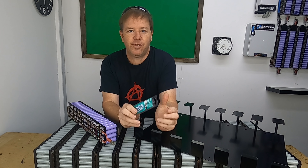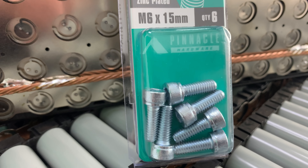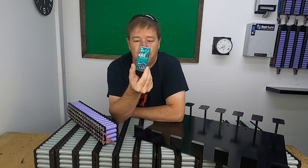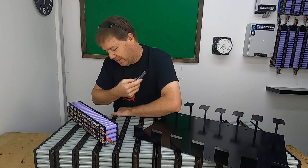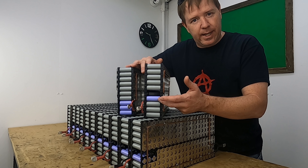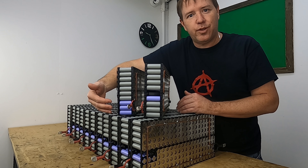The cells themselves will be joined together via the terminal lugs using M6 15-millimeter hex head screws and nuts — standard stuff really. With these blue cells here, we've got three cells towards the top of the mount and three cells here towards the bottom of the mount.